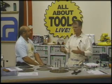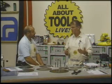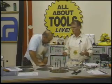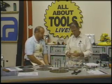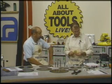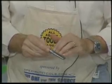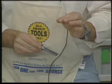The fact that solid surface has so much ATH in it, that is its main component, really roughly about 60% of the total material makeup. Mm-hmm. But ATH is alumina trihydrate. It's a mineral, as a matter of fact, used to make aluminum, but because of its abrasive quality, it dulls bits very fast. Very quickly, yeah. And so, because of that, you really have to pay attention to the carbide that is put on your tool. And carbide is not all the same. Right. I was fascinated to learn that.